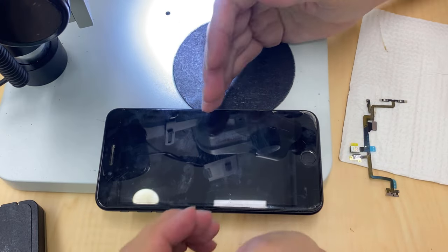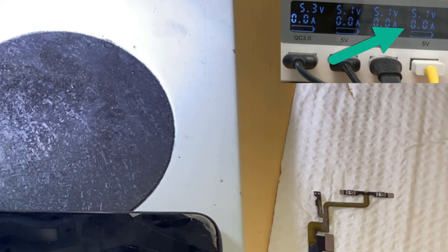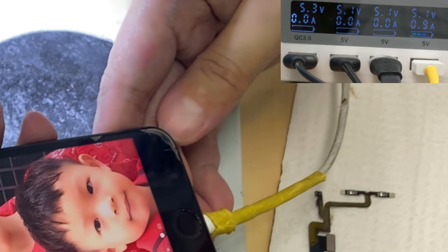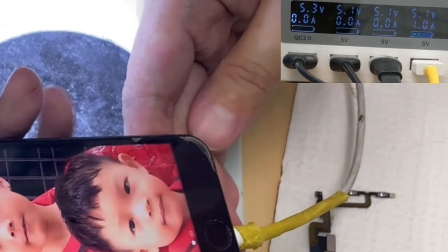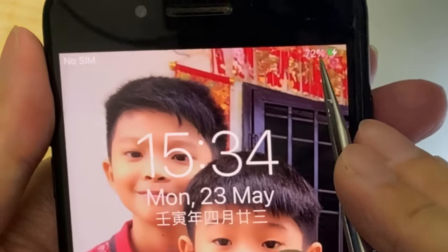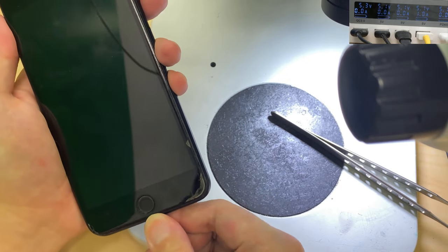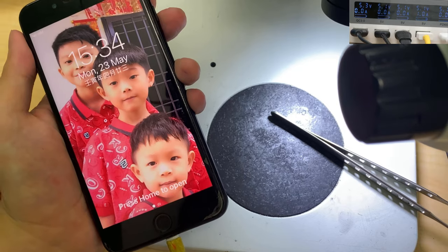Not only that — we also need the charging indicator, the device that checks the charging flow. Looking at this little box here, with the yellow cable I'm plugged in now. I need to see the charging flow speed. Now it's flowing 0.98A — the current is 0.98A, close to 1A, which is considered full speed. Charging speed really depends on battery percentage — especially 80% and above, it will slow down the charging flow. That's absolutely normal. We check both sides to confirm they have the same speed — we got 1A on both sides, very close, considered the same speed.